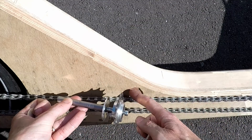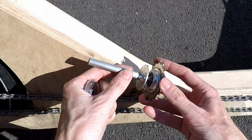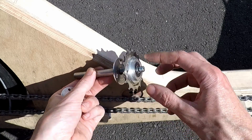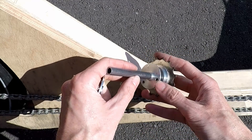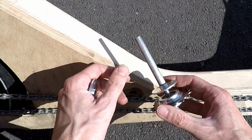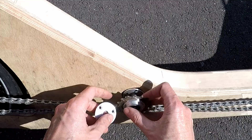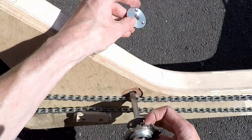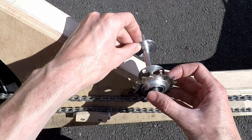If I remove one of the sprockets from the hole in the frame, this is how it works. There's a steel hollow shaft that I've turned up on the lathe, there's a mounting for the sprocket, and I've got these two flanged discs that allow the axle to be secured to the frame. I've not actually drilled the holes through yet. There's one that goes on the other side that supports the outer end of the shaft just to hold it steady on the chassis or the frame.